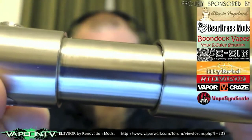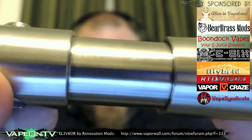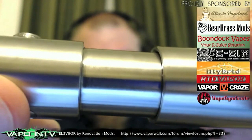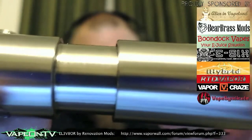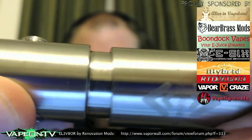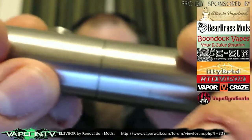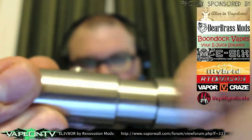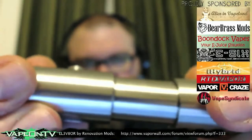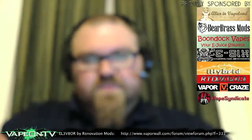Okay, now it's in 18650 mode. But then I want to go to 18500. Now see what happens there? It pops off the threads for the 650 mode and then catches the threads for 18500 mode. And then you screw that a little bit, and then it pops down again to go into 18350 mode. So you don't have to spend a half hour threading the device if you want to take the cap off, because you can see it pops in between the threads, and switch between different battery sizes, which is pretty cool.